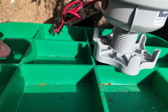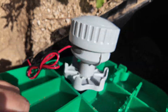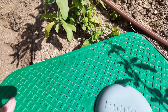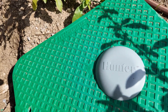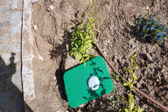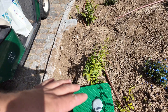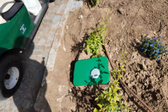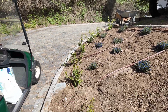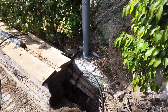You just have to drill a 38-millimeter hole on your lid, and then screw in this receiver. Before you ask how far this can communicate with the central controller — the farthest point on my land is about 600–700 meters away from the installation point, and the system shows 65–68% radio signal strength. So in this case you don't have to do the digging, trenching, or putting cable in the ground.